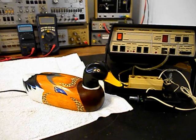It's been surged by electric on the telephone line and it has ruined the PC board. It's taken out both IC chips, your tone generator, and there is an associated chip for the tone generator because of the age and design of the telephone PC board. It also took out 4 transistors, 2 diodes, and some other components, and it blew the center off the surround of the 100 ohm speaker that was used for a receiver, the audio of the telephone.